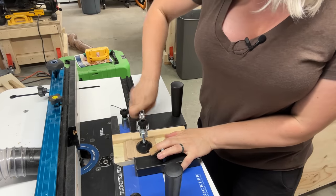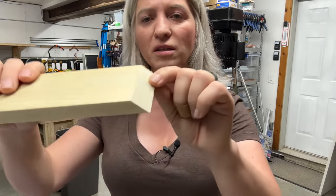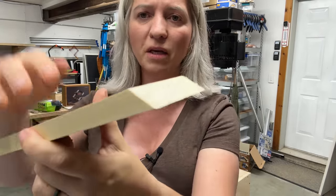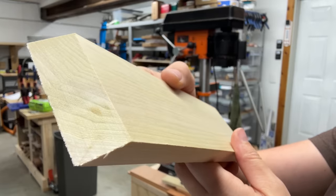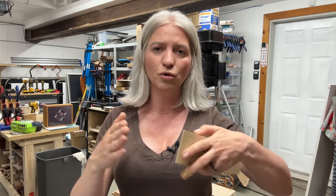Now let's see our result — a perfect miter, a perfect 45-degree angle, no chipping. Everything is crisp. This is what I use the coping sled for: doing my miters. Yes, you can do miter cuts on your table saw, but they're never this exact, especially on a jobsite table saw. Even when you use a digital angle finder to set the blade exactly at 45 degrees, it might actually be 45.2 or 44.8 degrees. When you go to put your box together, you'll have slight gaps. Setting up the blade on your table saw is just half the work.